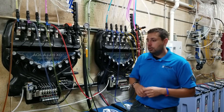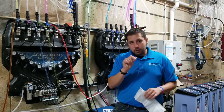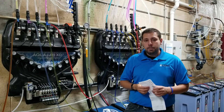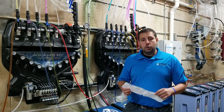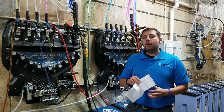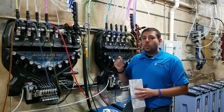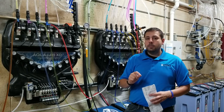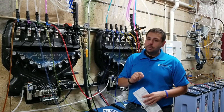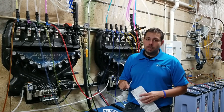To figure out the proper injector size, we consult our chart. When you order metering tips for injectors, you'll get small screws and metering tips from Hydroflex or DEMA, along with a chart like this one. This chart tells you that for a given injector size with a given metering tip size, what the dilution ratio will be. Let me warn you ahead of time — this is just a guide; it won't tell you exactly what it's going to be.